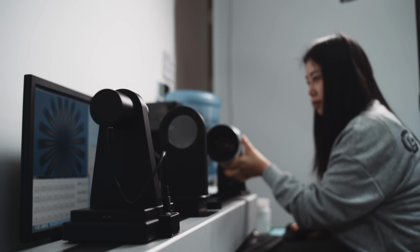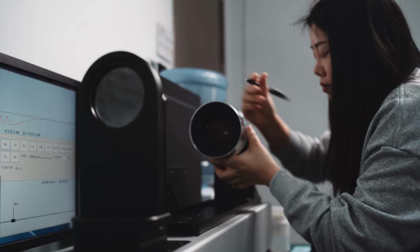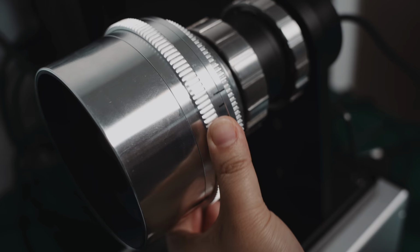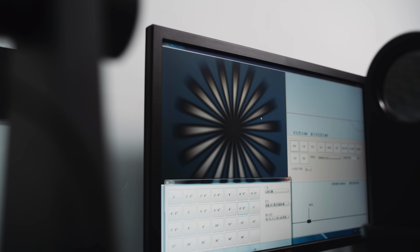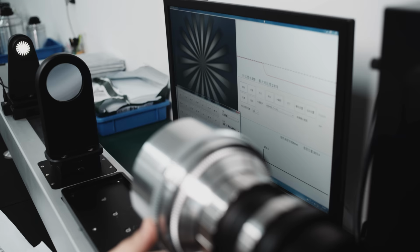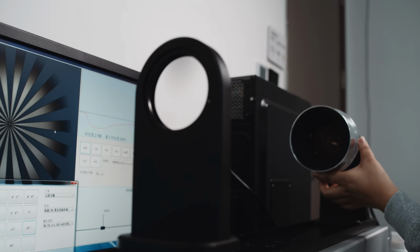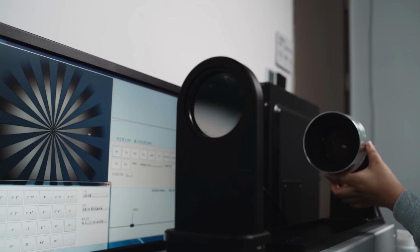This is distance measuring equipment. The expert is marking the correct focus points for each given distance with a felt pen, in feet or in meters, depending on the customer's wish to use imperial or metric systems. We opted for the imperial system. A diopter allows measuring longer distances up to infinity on a relatively short system. And by the way, GL can provide interchangeable scales on customer's request.